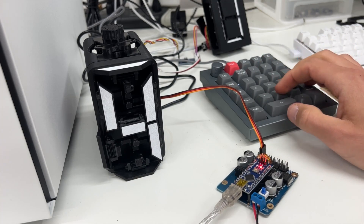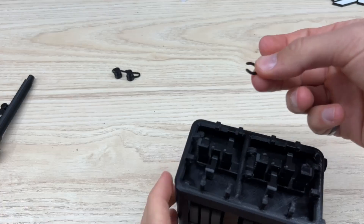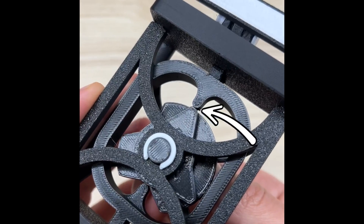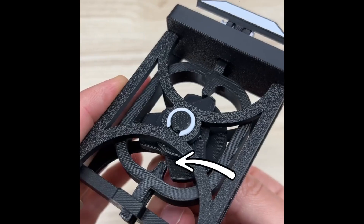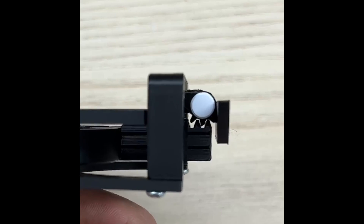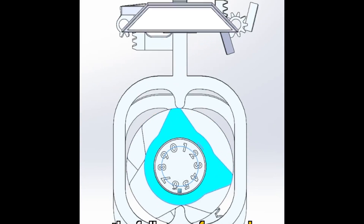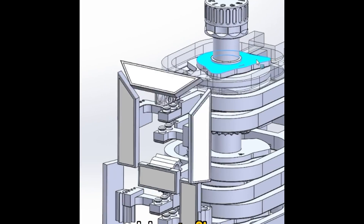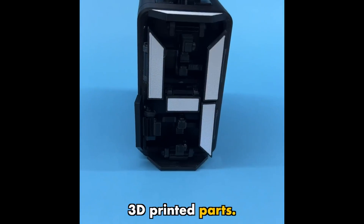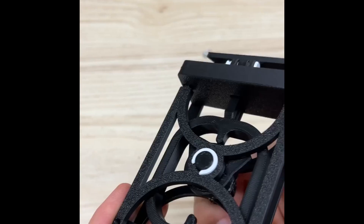The coolest part about having a design at this relatively large size is that you can really get a good look at the mechanical design behind it all. Essentially, each segment is pushed in or out using its own rack and pinion. But to determine what combination of racks are in or out to represent a given number, you have this central core of uniquely shaped cams running through the middle. As the dial at the top is turned, the cams are reoriented so that the different shapes press up against a different combination of the surrounding loops or followers that connect to each segment's pinion gear to push or pull the segments in or out of view.